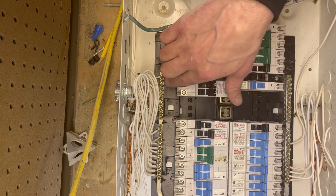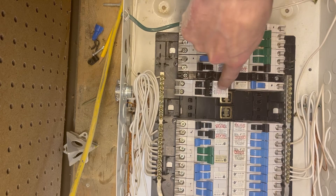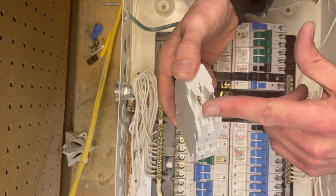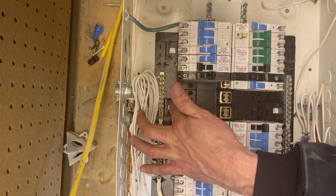So you want to make sure your breaker is off. You want to kind of rock it towards this edge by pulling up on the backside of the breaker. It's going to slide those teeth out — and this is what rocks on. It slips right into this piece right here.